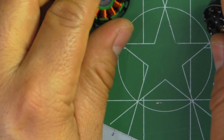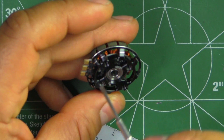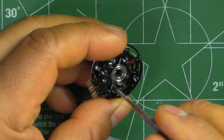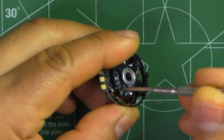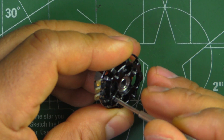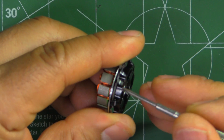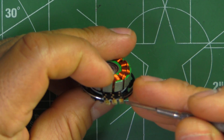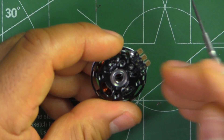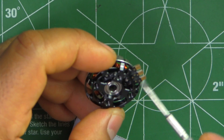By the way, this PCB also serves as a stop for the mounting screws, so you don't go through with the screws and hit the windings. But you also have to be careful — if you tighten it too much and you're not careful, you may end up cracking it. This PCB is somewhat thin, so it could be easy to crack. That's something to keep an eye out for — once you feel some resistance, it would be better to stop.